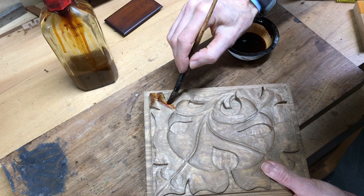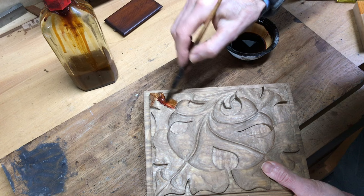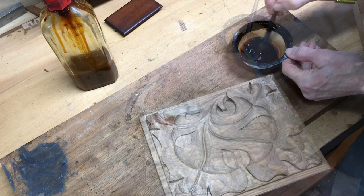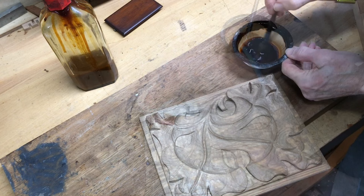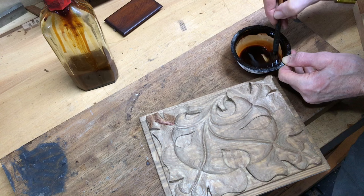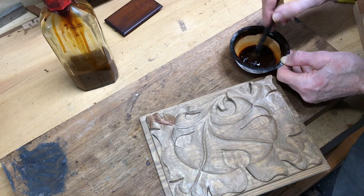It's still not going to look very good but hopefully you can see some of the colour hasn't dissolved properly — I'll try and wash that out and give it a bit longer. Normally when I mix them up I mix the dyes into just meths first, so you can see whether it's dissolved or not and you can see the colours in the stains. It probably dissolves a bit quicker that way, and then I add the button polish afterwards. But as I've mixed them together previously it's just taking a little bit longer.